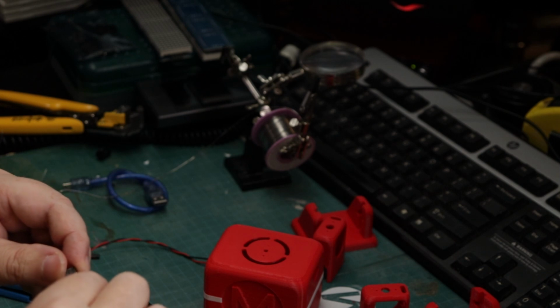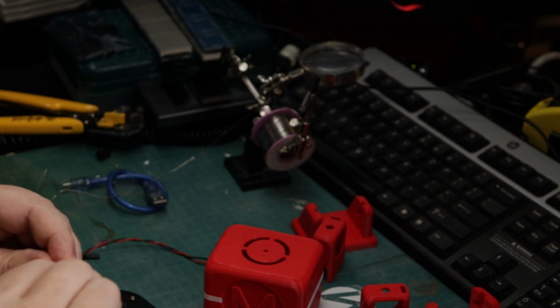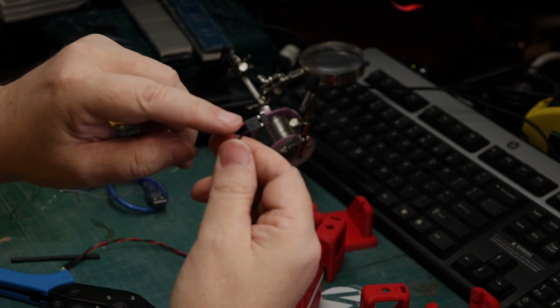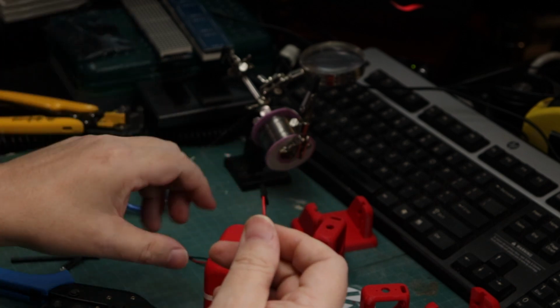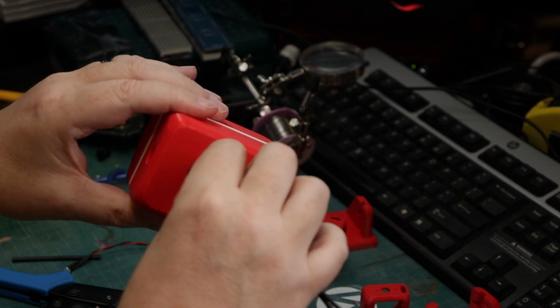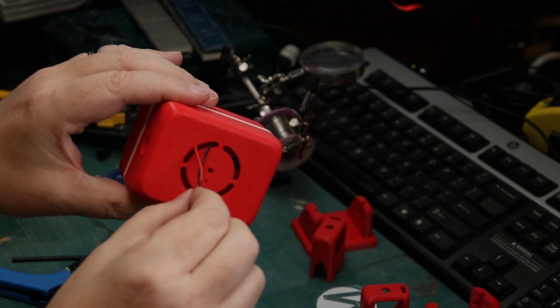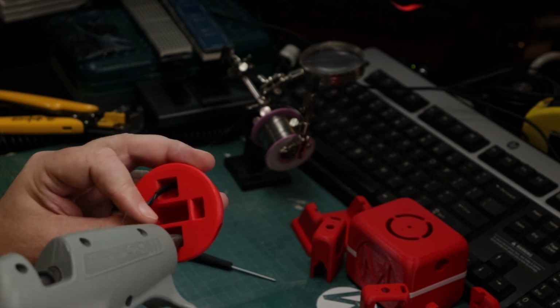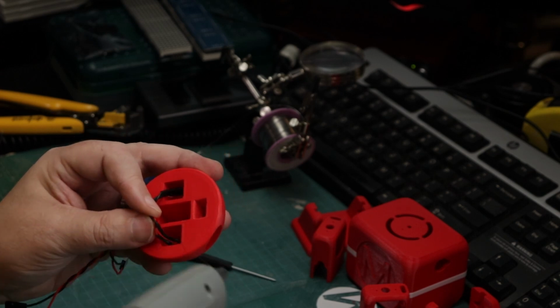And the reason I'm using a 3-pin connector and not a 2-pin or singles is that it gives me the ability to put this on the board in one spot and not futz around with other little connectors. And the reason I put them away from each other on opposite ends is because I want to send a signal. I don't necessarily want to send a positive. Now I've put the LEDs inside the head and just adding a little bit of hot glue here to hold them in.